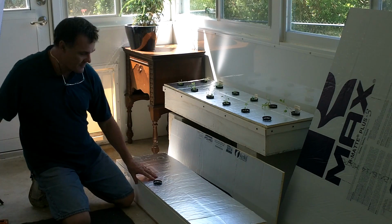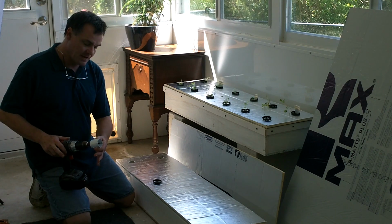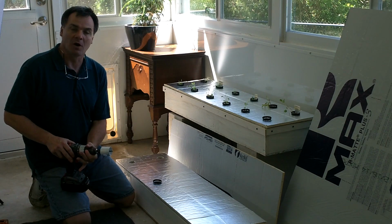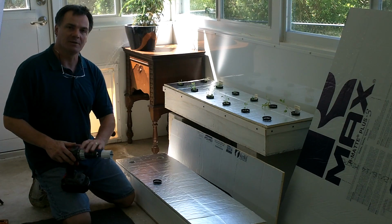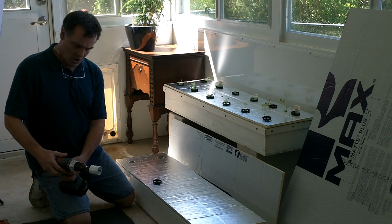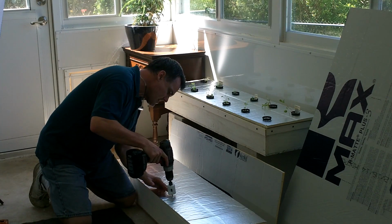And in order to cut that, we're actually using a 1 3/4 inch hole saw. And as I said, if you've watched our videos on building a VGS, when we cut our holes through a piece of PVC, anytime I'm using a hole saw like that, to prevent it from binding or grabbing, I always run my hole saw in reverse. So we're going to put that in reverse where we have our marks. I'm going to go ahead and put our bit there.